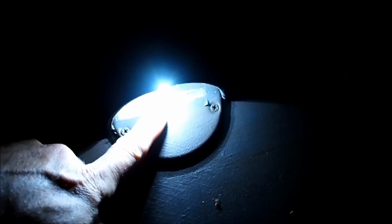You can't see it here on my video camera, but they're sparkling all across the landscape at night too. I'll post some photos in the blog post so you can see those a little better with the camera. And what we do is we just bolt into it. So these are the Malibu lighting on this deck. Again, you guessed it, replace the Malibu light bulbs with these LEDs that can run off of either 12-volt AC or 12-volt DC. I put in a DC power supply so that I could tap into it with this 12-volt to 3-volt down converter, and then just plugged in my flashlights with that barrel connector.